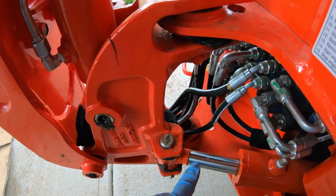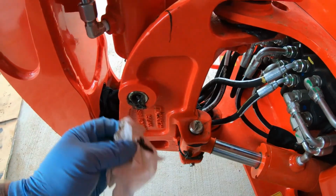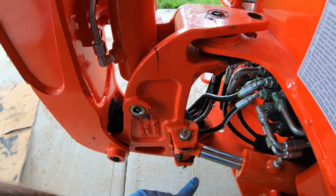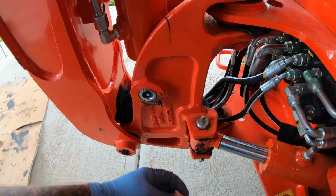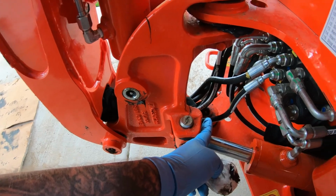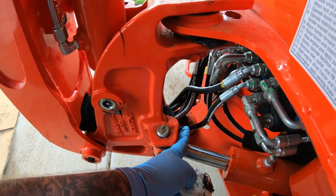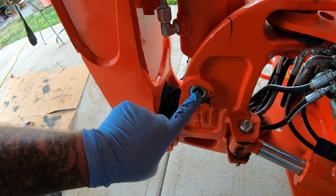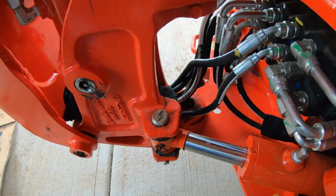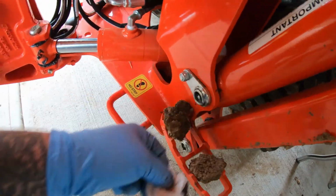This is one that we're going to be working on replacing, or taking out, because from the factory, this is the second time I greased it, and I missed that one. I saw a video online, people complaining that Kubota did not cover the grease zerks before spraying. As you can see in the paint right there, it is not exposed, it's covered with paint, and the ball bearing that is spring loaded inside the grease zerk is not accessible. So we're going to take that one off, see if I can clean it, and if I can't clean it and make it work, then I will replace it.